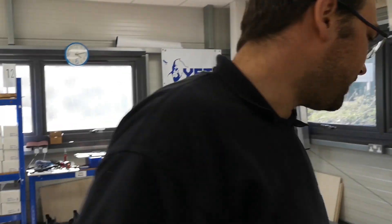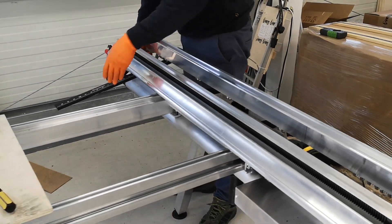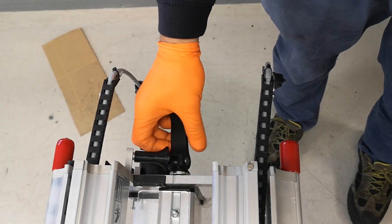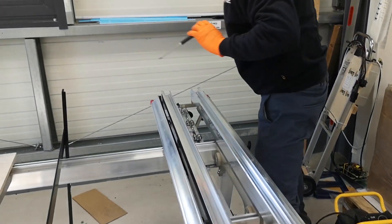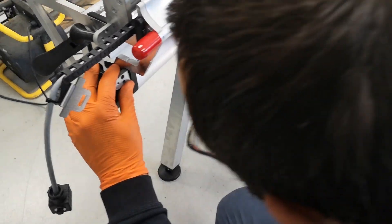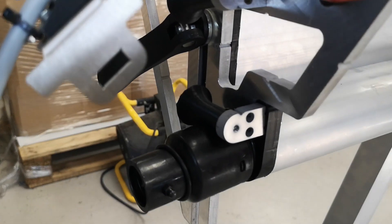At this point we can remove the engineering square. Power off the machine. Install the clamp washers and set the position of the extraction roller — just flick it back into position. Drive in the top screw, tighten the bottom one, and at this point we are ready to use the machine.